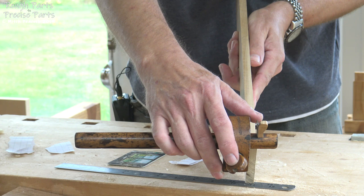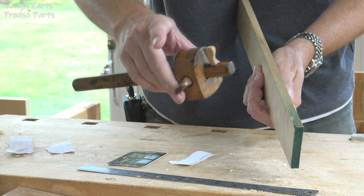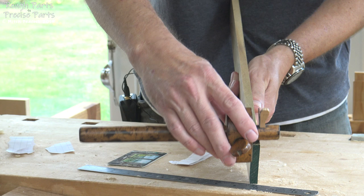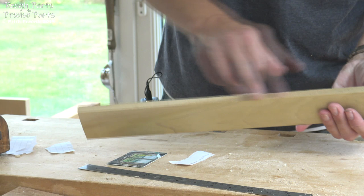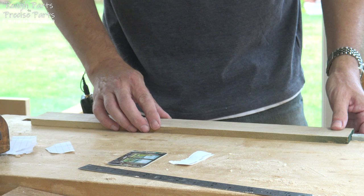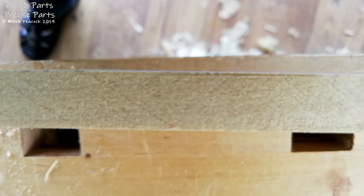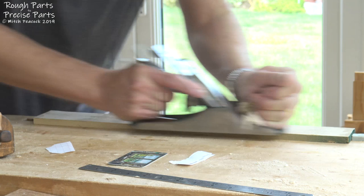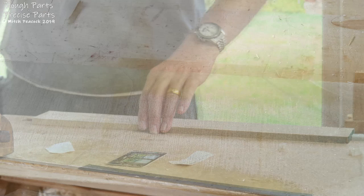You'll notice I'm working with the stock of this gauge — the fence, if you like — against the flat plain side. Just by eyeing it I can see slightly more to remove here than down there, and there's more on this side of the board than the other side. Checking our planing direction, you can see the knife line here at the top of the board showing the thickest amount of material that needs to be removed. Gradually coming down to a nice flattened area, the saw marks are gradually going. We'll continue to selectively plane until the knife line just crumbles away all the way around the edge.